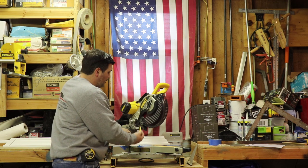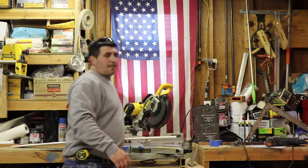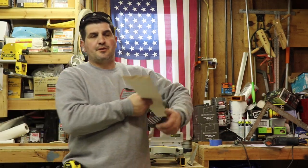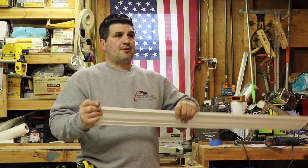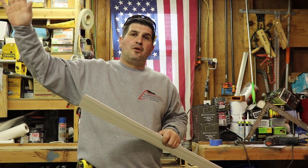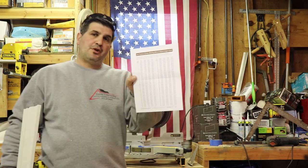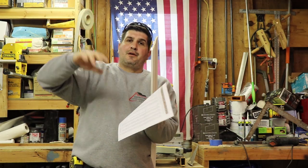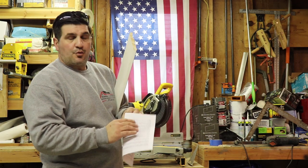The only time I do it on the flat is when the crown exceeds my saw depth. The advantage of coping versus just gluing your miters together: sometimes in an old house the corners are out and not a perfect 90 degrees, and you really have to work to close your gaps. With coping, it helps a lot when the corners of your walls are not a perfect 90. That's also the advantage of cutting on the flat with Joe Fusco's chart because it gives you different degrees - if you have a digital protractor and the corner reads 94 or 95 degrees, it adjusts for that.